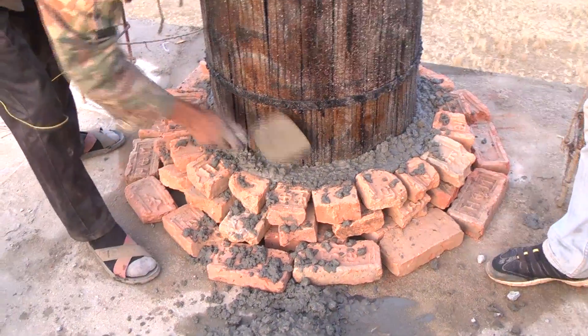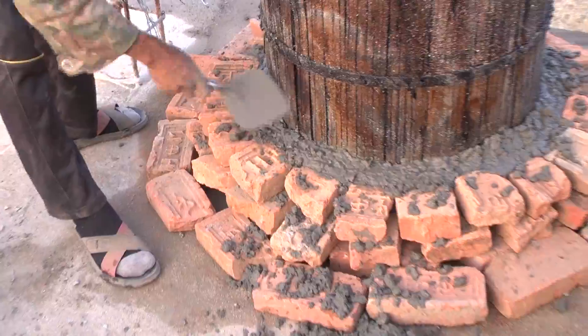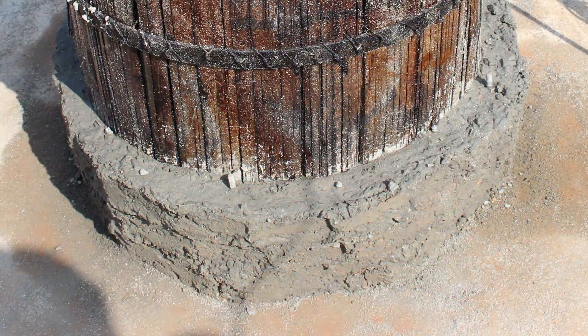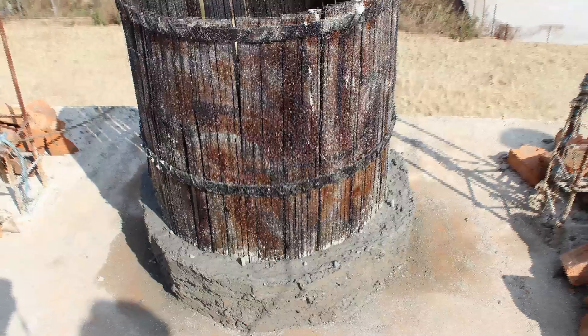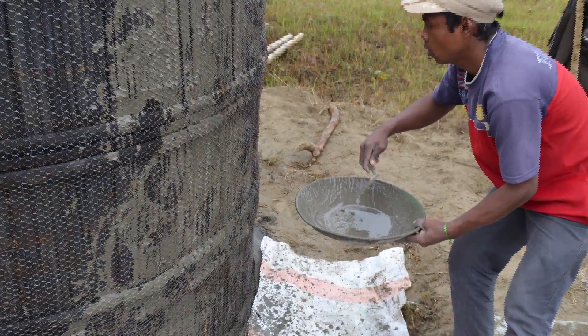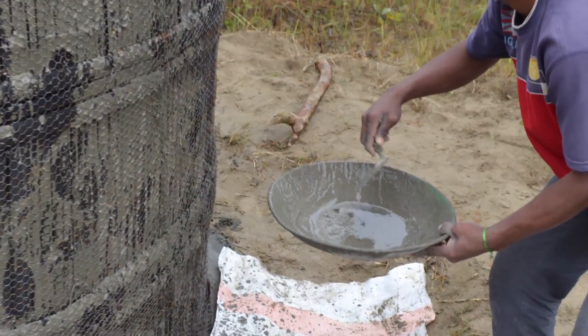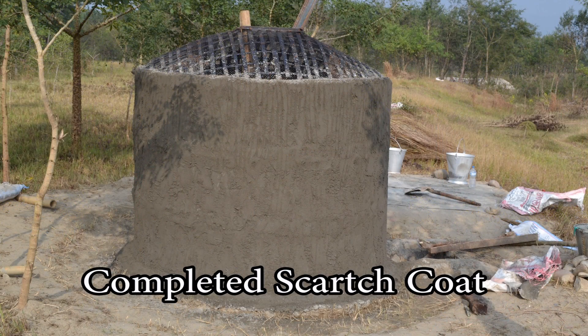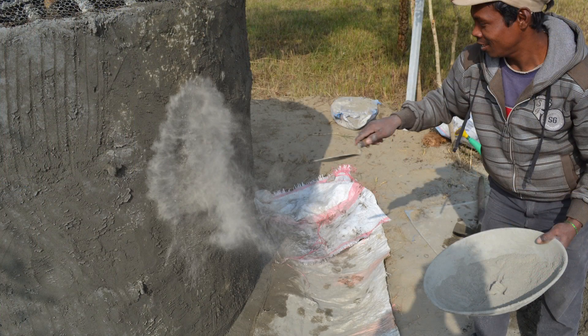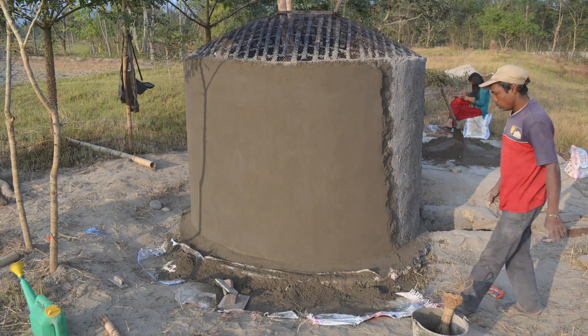Remember, you should apply a thicker layer of concrete around the bottom of the tank as this will carry the maximum hoop stress when loaded. After this, you must remember to splash the exterior tank wall with a mixture of water and pure concrete before adding a first scratch coat of plaster. Once the scratch coat is completed, you must wait one day and then you can add a final exterior coat.